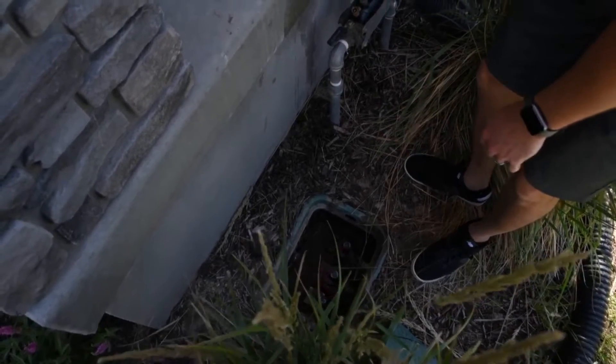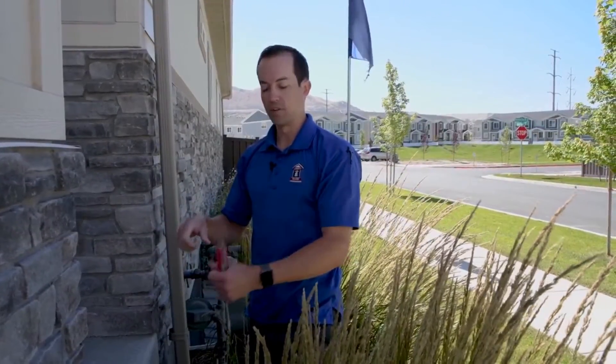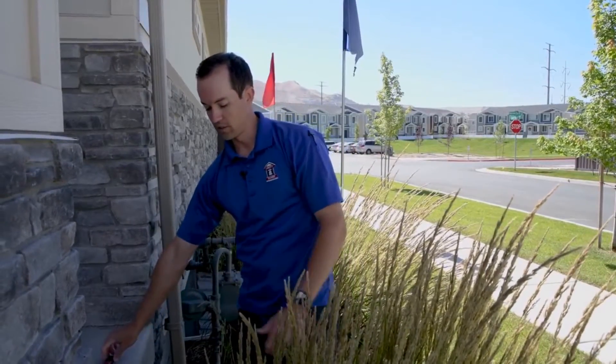We're trying to get the water out of this valve and out in the basement. At this point, go to your drain valve, take a big cup or bucket, go down under that drain valve that I showed you, and open it up and drain it until no more water comes out of your line — maybe a big cup's worth, so it shouldn't be a whole lot of water.